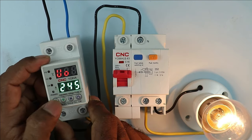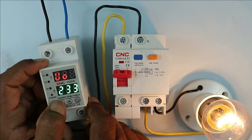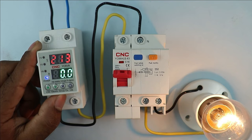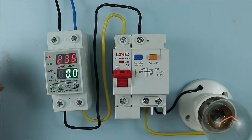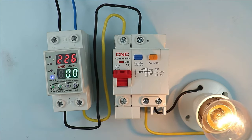For overvoltage, I previously programmed 245V, but let's decrease it more — I am setting this to 230V. If the value goes beyond 230V, the lamp will be turned off. Right now the voltage is 213V. Now I will start increasing the voltage. After increasing, it is now 236V. So after 5 seconds, the lamp will turn off. You can see — the lamp turned off. Now I will decrease the voltage back. The voltage becomes around 210V, and when the voltage returns to normal, our lamp turned on again, meaning this device restored the power supply.